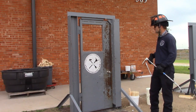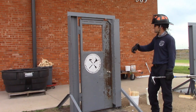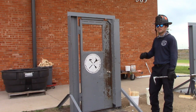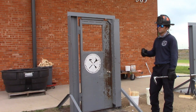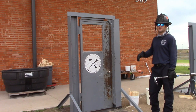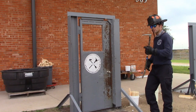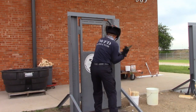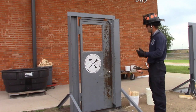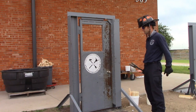When it comes to shocking our inward swinging door, we're going to hit it in three spots — at the top, the middle, and the bottom. The purpose of that is to loosen those locks up if they're weak, maybe even open our door, and by the flex and give in the door we can roughly figure out where those locks are located. This door had a lot of flex at the bottom, a little bit at the top, and it's pretty solid in the middle, so we know our latch is somewhere in the middle.